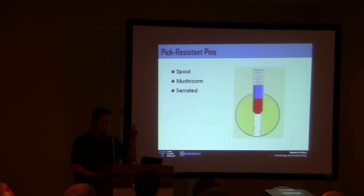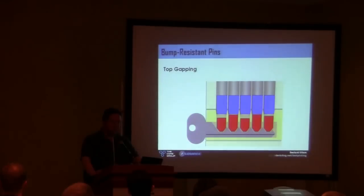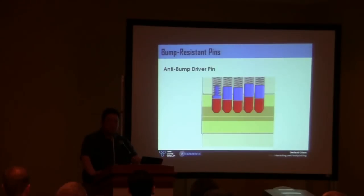It is what makes this lock pick resistant, in my mind. You can resist bumping really easily. A simple way of doing that is putting some gaps in the pin stack so the physics of bumping doesn't transfer energy correctly. There's even an anti-bump pin — by making one pin less weighty than the other, it will actually mess up the physics of how the pins fly around. Talk to me more in the Q&A if you really want to get into retrofitting and changing your locks; I'll tell you some tips about it.